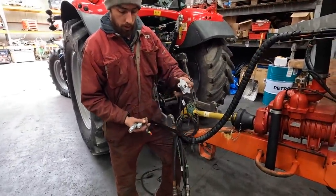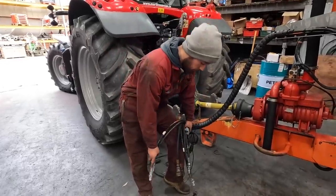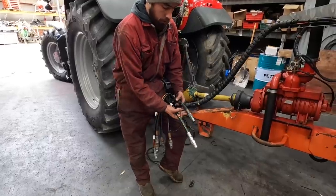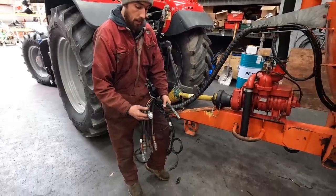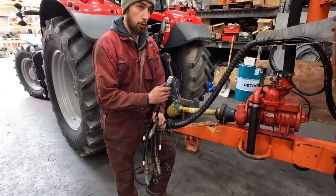And when you flick your switch over, the second function then will run the mast rail. And then on our other pipe we have put in, it will work together along with your original splash plate pipe. They need to go in because we're running a double acting valve, so you need the two of them. And then if you just need to go splash plating, you're just putting in the one with the red tag and just quick release over.